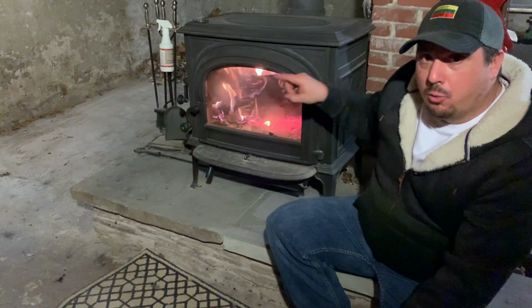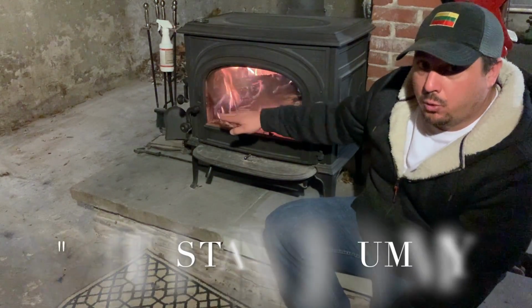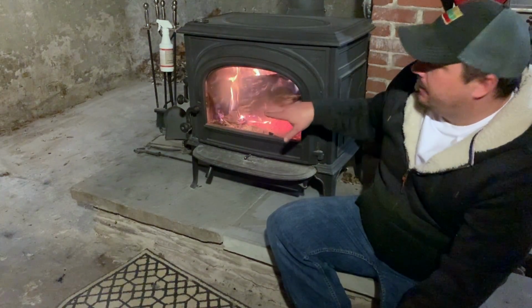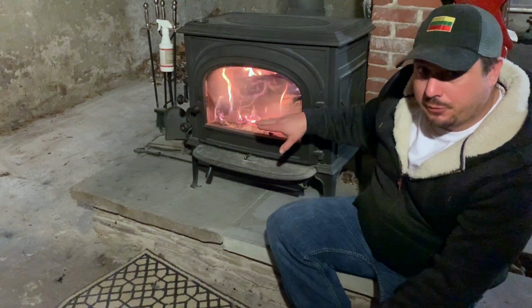And it will not clean off because, and this is a very important distinction, it's not dirty, it's damaged. The first thing about what we call wood stove glass that most people don't realize is that it's not glass. There is no glass that could withstand these kinds of temperatures and not shatter the first time it was touched, or simply melt at the very high temperatures that these stoves get to. What this is, is a type of pyroceramic. It's obviously a clear ceramic and it's extraordinarily durable.